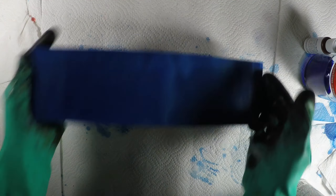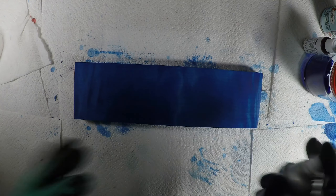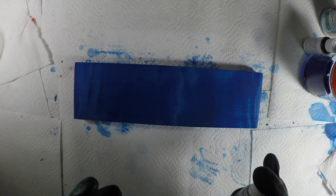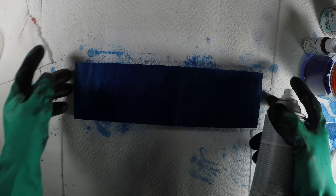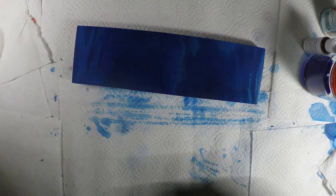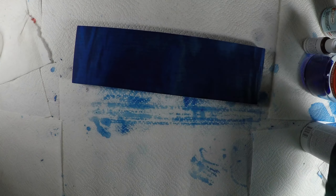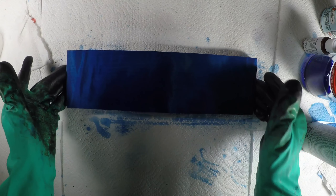I'm just making sure there's no fuzz on it. I'm not sure what you're using for a topcoat, but this is how I'm going to do this: I'm just going to dust it with lacquer on this portion and then let that flash off, and then I'll apply a second coat. So I'm just dusting it on — as you can see it's just a dusting. It went a little heavy there but that's just the dusting coat that shows up pretty well.